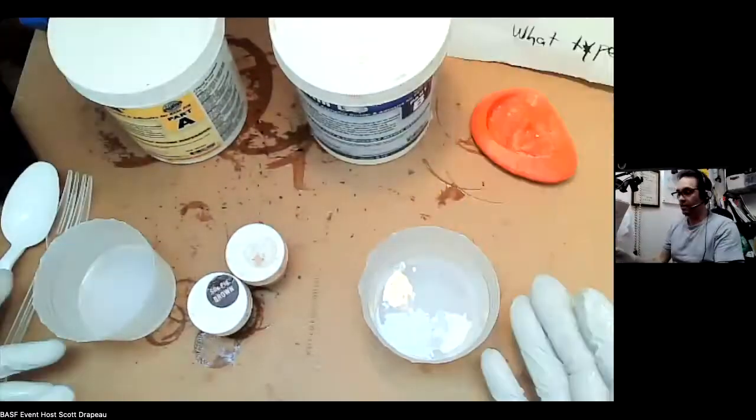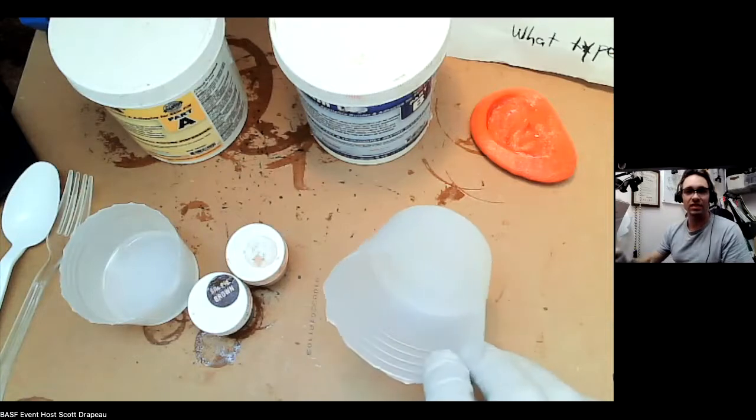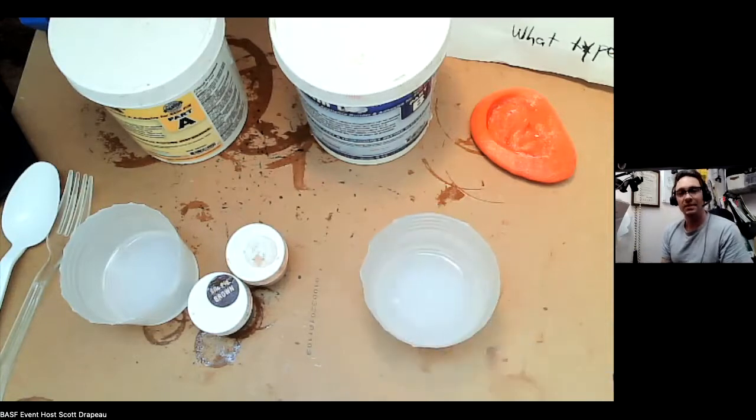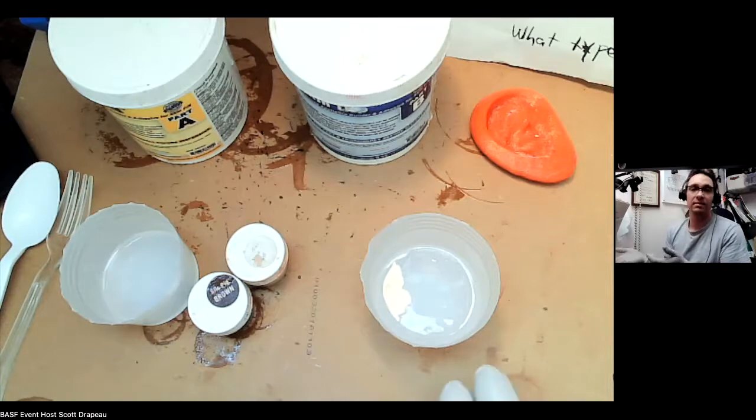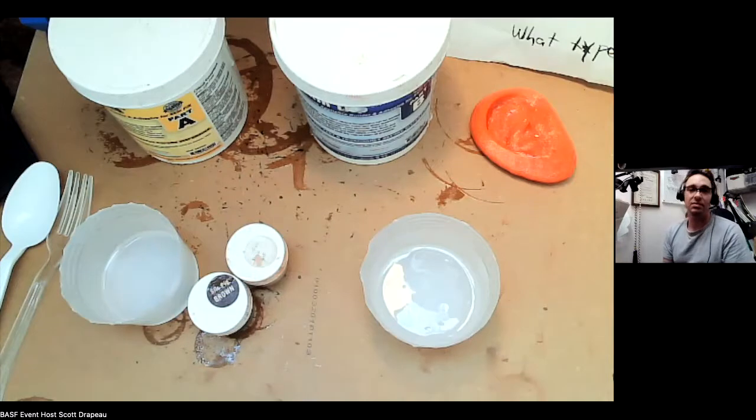All right. These A and B cups of silicone will not do anything just like this. They're gonna stay exactly like this, nice and viscous and runny and goopy. Once I mix them, you're gonna have a reaction. The silicone will start to harden. It's called a catalyst. So we have our non-catalyst and our catalyst. And once you mix, they turn into a rubber of sorts. So the good thing about this is that I have flexibility. I can work on this and not worry about time.